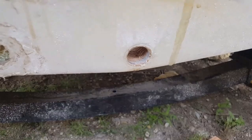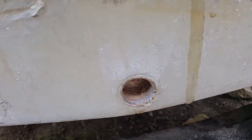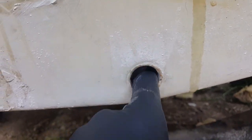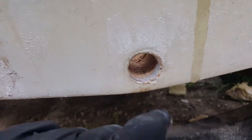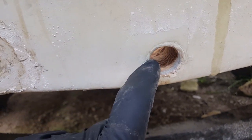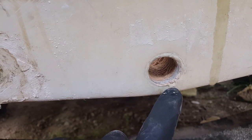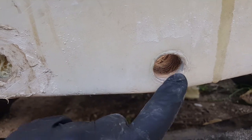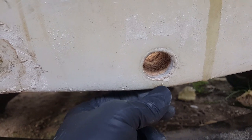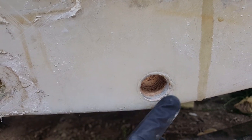So as you can see here, I've already drilled this one out and you can see through all the different layers of marine-grade plywood — it worked out really really well. You can see where the old brass flare was; it still has the marking on it. We also have some unevenness with the gel coat and what looks like a drip of epoxy, so we're gonna clean up this area with sandpaper first.